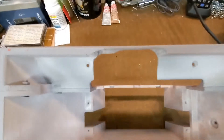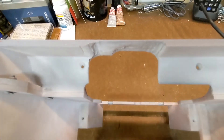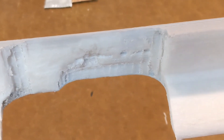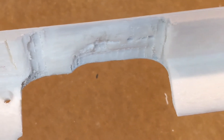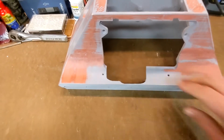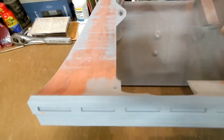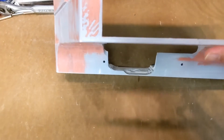If you look along the bottom, you'll see that I took it almost down to nothing. But with a little bit of careful dremeling and clearing away a lot of the material, you can see even some of the infill and some of the structure there worked out pretty well. It does bring up a lot of people's concerns about PLA and warpage with temperature. All I can say is it heats up and gets a little bit soft, but it cools down almost instantly. I didn't lose any of the detail on these recesses — it didn't turn to liquid or goo. If you're careful and use common sense, I think you're fine to dremel any material out if you need to.